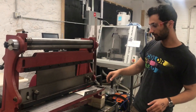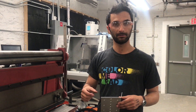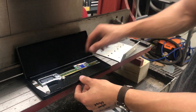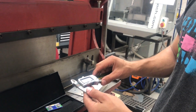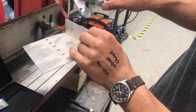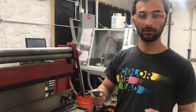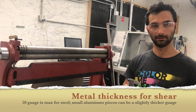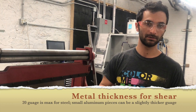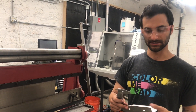We'll start with the shear at the bottom and work our way up. So this is a piece of aluminum, and I'm just going to grab our calipers to measure it. We have both digital and dial calipers, depending on what floats your boat. These let you measure in millimeters, inches, and fractions of an inch. We've just closed them and pushed zero to zero it out. We take our piece of metal, close it up, and we're at .06 inches. Before I said that 20 gauge was the maximum thickness for steel, but for aluminum you can probably go a little thicker. For something like this width, going down to 16 gauge is probably okay.